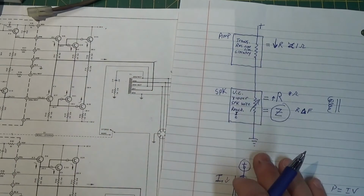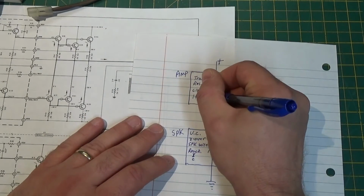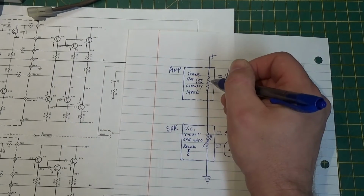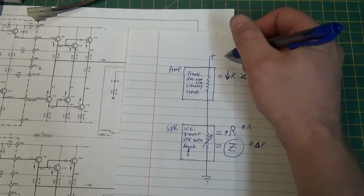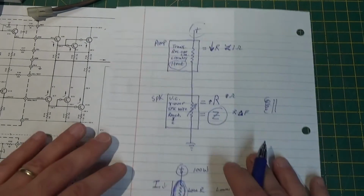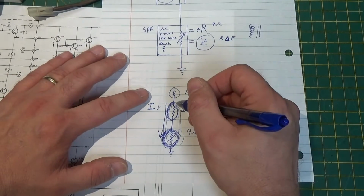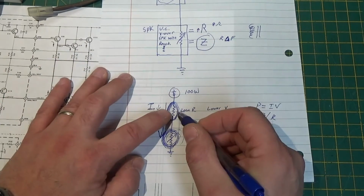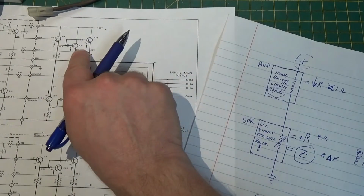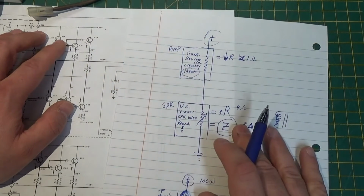Okay, and anytime you create heat, heat is also part of our absorption. As this converts electrical energy into heat energy, part of my voltage up here is being lost in this heat. So the lower I go in impedance on my speaker, the more demand current-wise I'm going to put on this, and as I dissipate more current through my circuit over here, I am also going to convert more of that current into heat and lose energy.